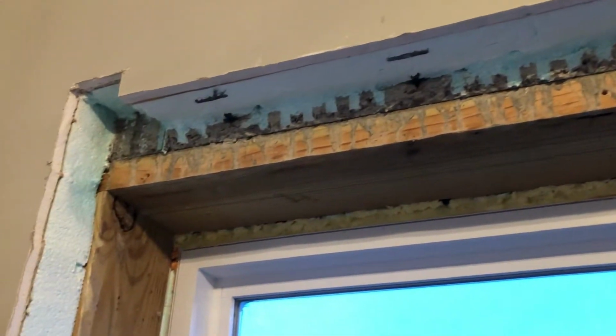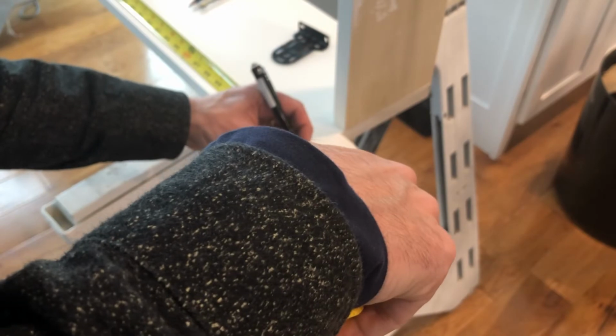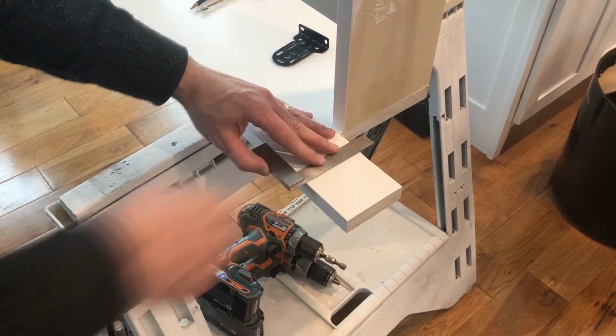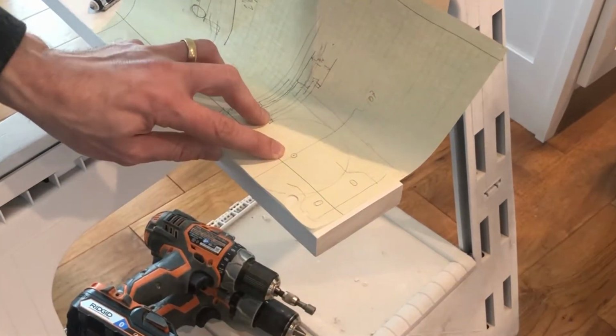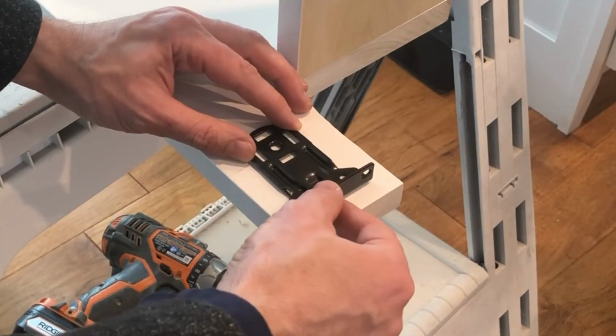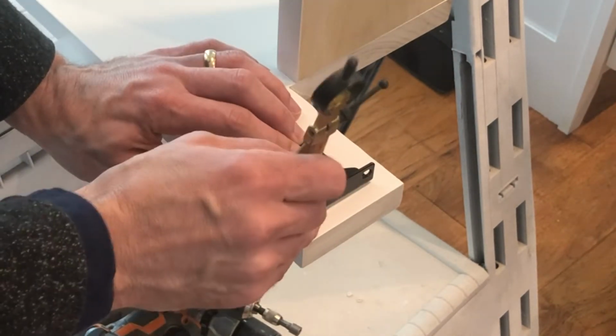Because my walls are ICF, I could take a 2.5-inch chunk out of the foam, and the 1/2 inch of drywall gives me 3 inches to work with to perfectly recess the blinds behind the trim. I measured up from the bottom to make sure the blinds were at exactly the right height on both sides and marked that center line. I then made a template of the diameter of the blinds and marked where the bracket would need to mount, and then just used that piece of paper for all of my trim to get them all exactly the same.